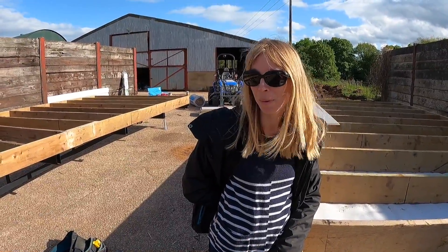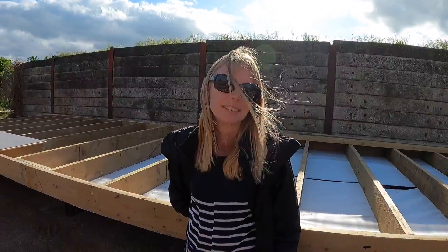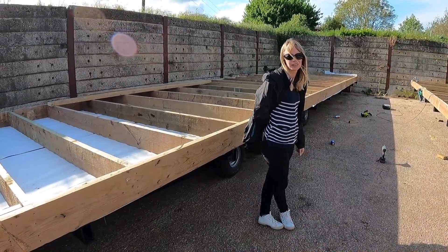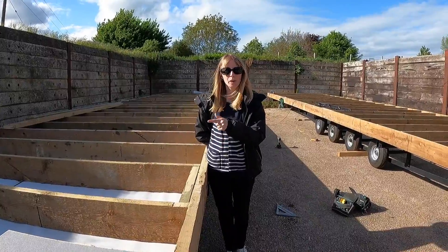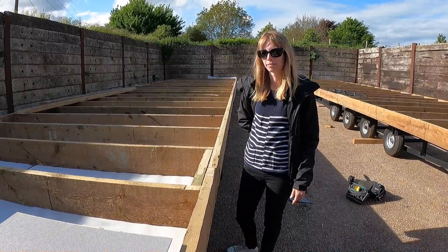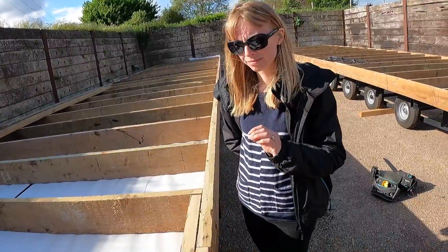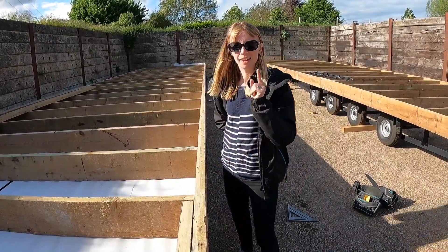What's next then? More membrane. And then maybe insulation and floorboards — that should be way easier. I can get this membrane done this evening maybe? No probably not — it's a two-person job, you've got to lift the frame up and slide it under. I think we should do the floor on the other one first because it'll mean it's watertight and give us a bit of a win before we hit the membrane job — that isn't the nicest job. All we've got to do — annoyingly these are 1.5 metre membranes, there's a cover strip, a half strip to go down the middle. We're just going to jack it up and slide it in — peg it down, staple it on one end so it stays in the middle, then go up the other end. In my head that works really well. But there we go, that's as far as we got.